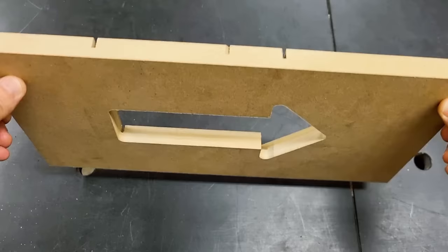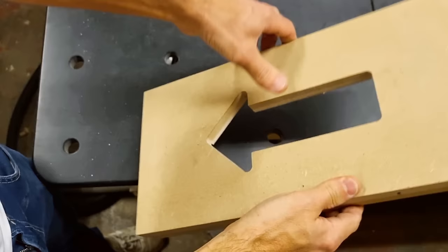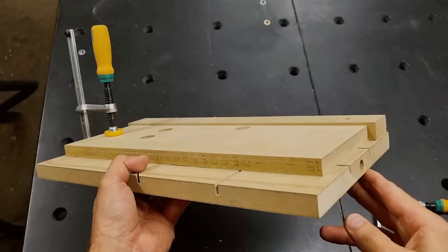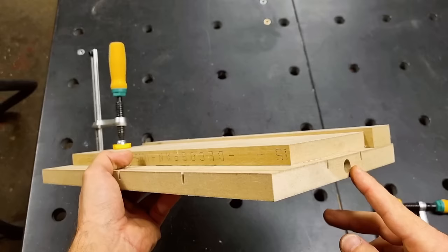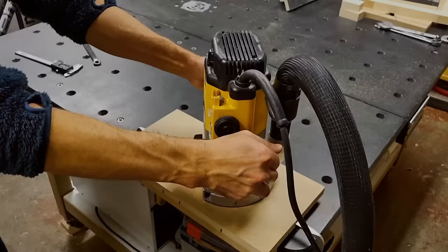There are also a few optional steps. The first optional step is to add guides or reference parts to your template — for instance, to make sure that all your routed arrows end up the same distance from an edge. The final optional step is to add holes from the side so you can clamp the template to your workpiece. For one-offs, double-sided adhesive will do.